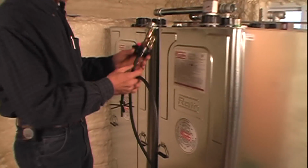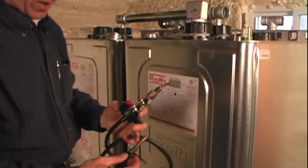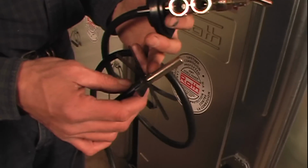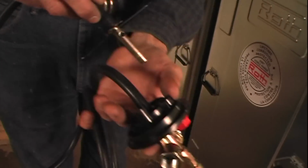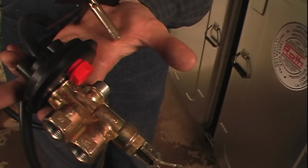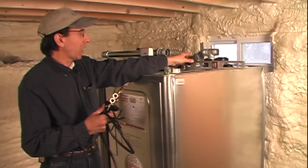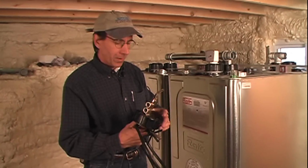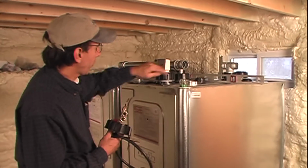This is the device that is used for getting the oil out of the tank. And it's basically a hose. It goes to the bottom of the tank, and it has a pickup in the middle. It doesn't sit in any sludge that might be down there. This would stay off the bottom, and you can see the holes right there. So the lowest it would be a couple inches off the bottom of the tank, and it would extract the oil. It goes in the same way with these very nice big connectors, and will go in the appropriate location, and they'll probably be in the front here.